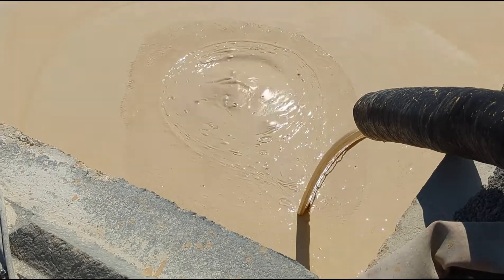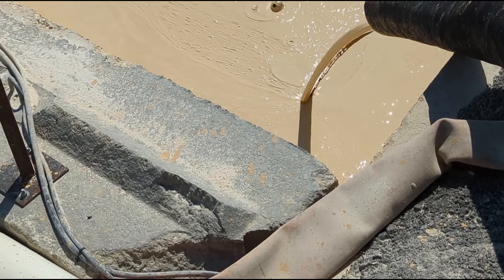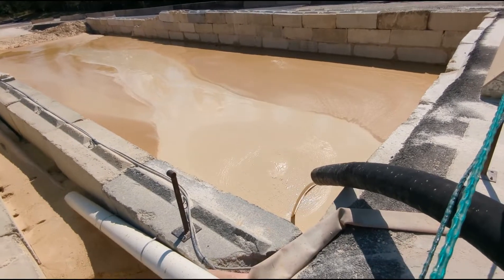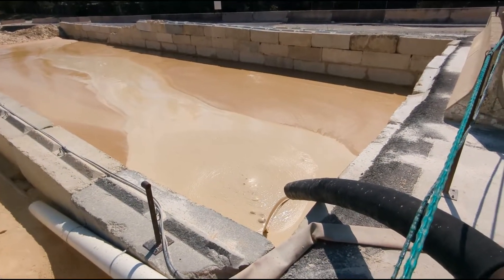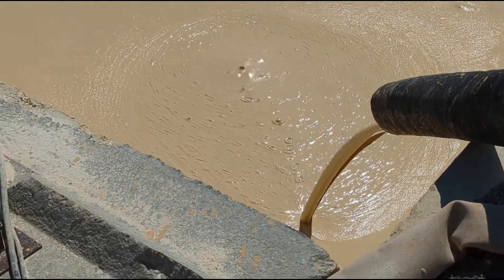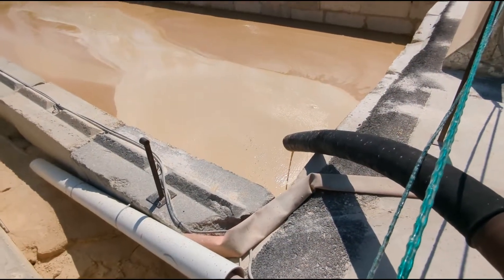You can see the consistency of that mud. Even though we're not even ready to discharge yet, it's already quite thick. That's what allows for these short drying times and the ability to drive into these cells. The plant manager indicated he's been able to drive into them as early as four days after filling — so we can clean them out with only four days of rest. When the mud is cratering like this, we know it's around 50–55% solids by weight. The clarifier itself isn't set to automatically discharge until 60% mud, so everything's going quite well.